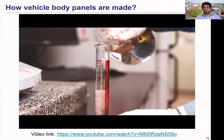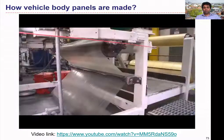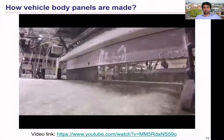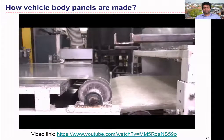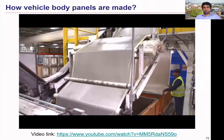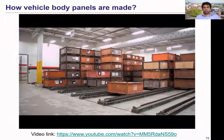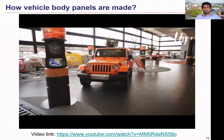To ensure quality and product consistency, in-house chemical labs continually test the materials for viscosity and other significant properties. The compounding process begins with a roll of plastic film fed through the transport system. The machine deposits a layer of resin compound on the film, then chopped glass cut from stranded rovings is dropped on the resin in random orientation. The upper layer of resin film is then placed on the lower layer to form the composite, which goes through a compaction roller system to remove trapped air, wet the glass fibers with resin, and press it to the desired thickness. The composite is then packed in shipping festoons and taken to the maturation room, where it is stored for one to three days until optimal viscosity is achieved, then shipped to a manufacturing facility to be molded into Class A body panels.